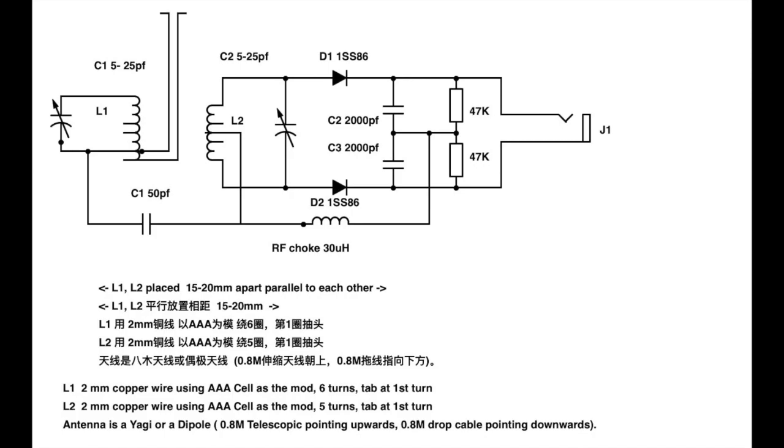As the carrier frequency moves to one side of the center frequency of the station, the balance condition is destroyed. One of the diodes conducts more than the other, and this results in the voltage across one of the resistors being larger than the other, and a resulting voltage at the output corresponding to the modulated frequency of the incoming signal.